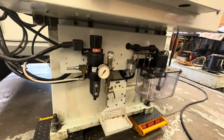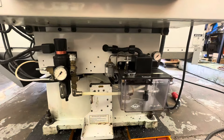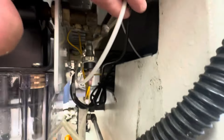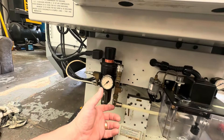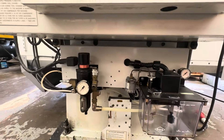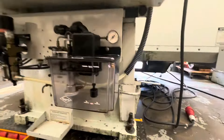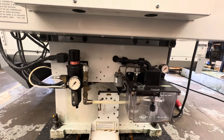So that's the air lube panel refit to the machine - all nice and clean. I'm going to top this up now. What I did do was replace the main line between the back feed into the machine so it's longer, because what you find is when you unbolt this and try to take it down, that line's too short and you end up hanging on it. I've done it on the other machines as well - I replace it with a bit that's about two feet longer so when you unbolt this you can put it straight down onto the floor.